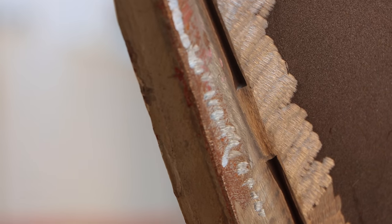If I hold on that for a bit, you can see it's a bit hard to tell from this angle. You sort of look down along the length of the weld, you can see that it's rounded into itself all the way down. The point of doing that, rounding those welds right out, it basically allows you to get the wire right into that root, so you're not driving over top of a pre-existing weld. You've essentially ground it out, so yes, it's still there, it's still holding some tension, etc., but it's not so pronounced that it's going to cause an issue.